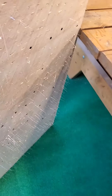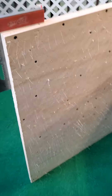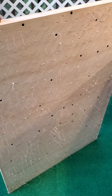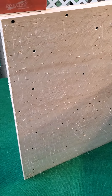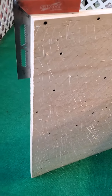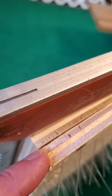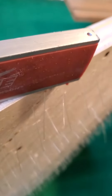I've got a gallon of epoxy to put on the top to hide all of the stuff here. The screws I put in when I glued it together to hold it still, I'm going to leave them in because they give some shear strength to keep the glue from breaking if somebody leans on the corner. Clearly there are some spots where I didn't quite get it all the way together, but it should hopefully be fine.